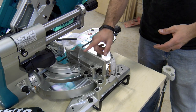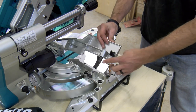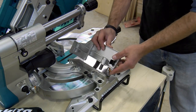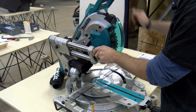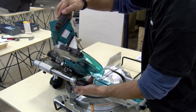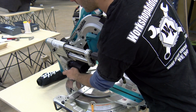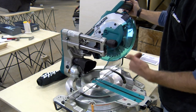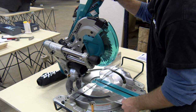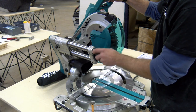When making a bevel cut with this unit, you need to remove the upper fence sections. There's a black wing nut knob on the back — loosen that, remove the stud from the socket, and the fence is removed so you can tilt the saw to make a bevel cut. There is a locking knob on the front: turn it counterclockwise to loosen the mechanism and you can go left all the way to 45 degrees. To the right it stops automatically at 90 degrees, except there's a button to release it off the 90-degree detent and allow a bevel cut to the right-hand side. If you go back to the left, that detent kicks back in place at 90 degrees and you can lock it.